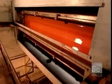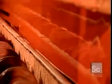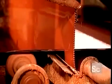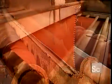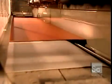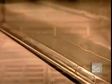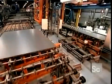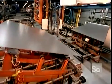The panel passes copper side up through what's called the curtain coater, a machine that runs a continuous curtain of paint across the conveyor belt. With its fresh coat of paint, the mirror then passes through an oven heated to 210 degrees Fahrenheit. After a minute and 45 seconds, the paint is cured. Now the second coat of paint is applied — there's no reason for the different color other than to differentiate the coats. This time, the curing period is twice as long and at a higher temperature, close to 245 degrees Fahrenheit.